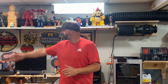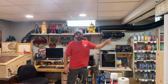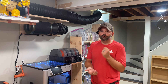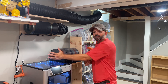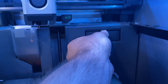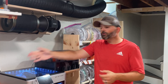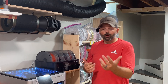Over here I have my laser cutter with a duct that runs outside, blowing smoke and fumes outdoors where they can't harm anybody. These 3D printers are printing plastic, rubber, and other materials that can release toxins into the air. The back of this X1C has a small activated carbon filter — when the chamber vents, it blows exhaust air through that carbon so the air is scrubbed and clean.